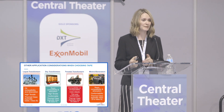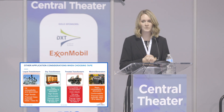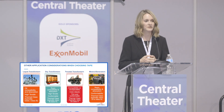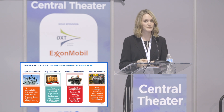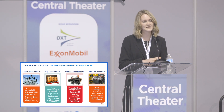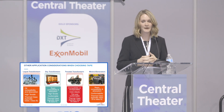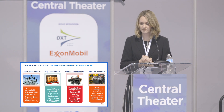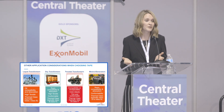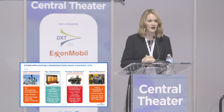There are many other applications in these categories. For a liquid transformer, look at oil compatibility — how well does the tape backing absorb oil and how compatible is the adhesive in oil? For dry transformers, look at resin compatibility and absorption. For toroidal transformers, color may be important if the tape is exposed on the outside — black is very popular there.